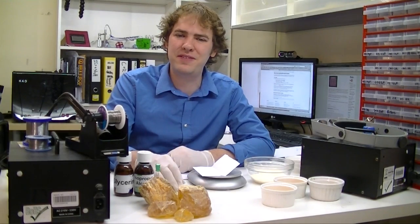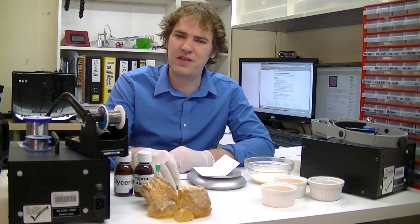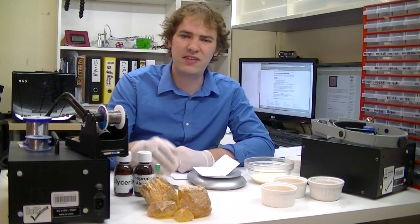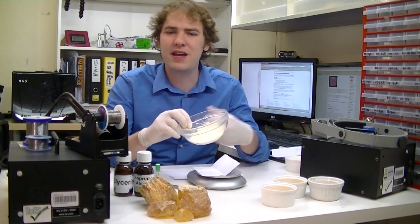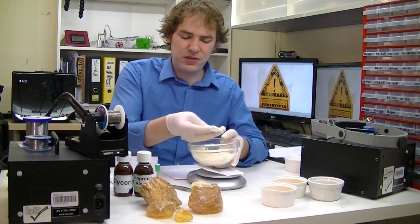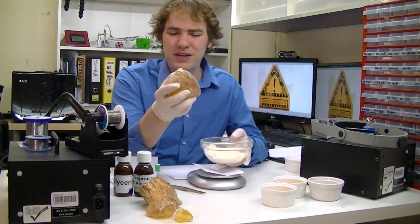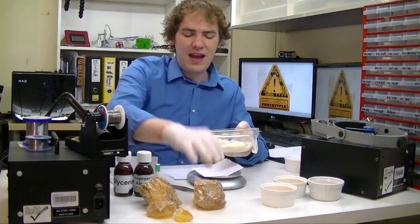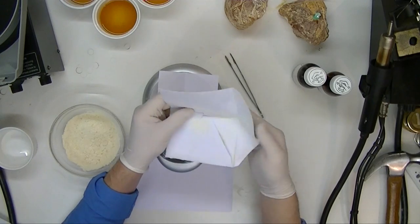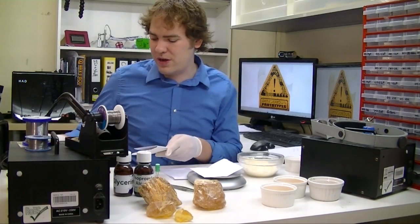Now we're going to make a batch of homemade flux. The idea came out of the forum, so we have other people's experience to fall back on. There are also a couple of expired patents about flux that say the concentration of rosin powder can be anywhere from 20% to 85%. This is the rosin powder we'll use. It comes from big blocks that were sent in by a helpful reader. We crushed them with a hammer, then put the smaller chunks in an envelope, folded it in half, and crushed it again to get a nice powder so it dissolves quickly. That works surprisingly well.